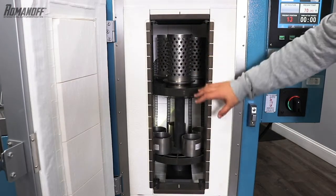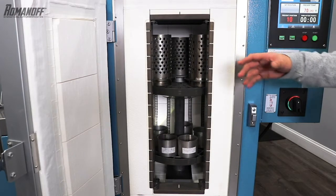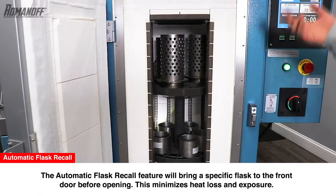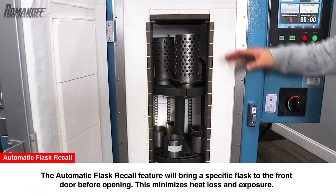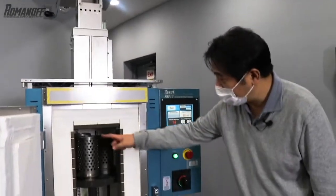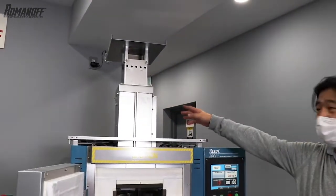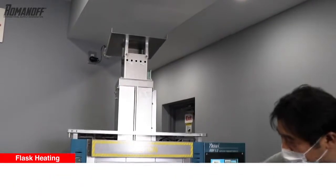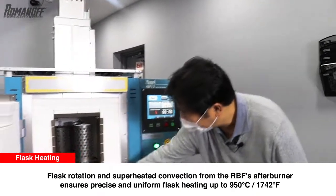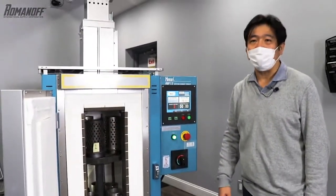The reason why heat distribution quality is very important is that each step — the first step is to dry, the second step is hardening, and the final step is to make the investment hard. What we need is this heat distribution — not only the heating wire produces heat, but also the afterburner burns at a higher temperature than what is inside, making the air circulation more equal to achieve even heat distribution across both chambers.